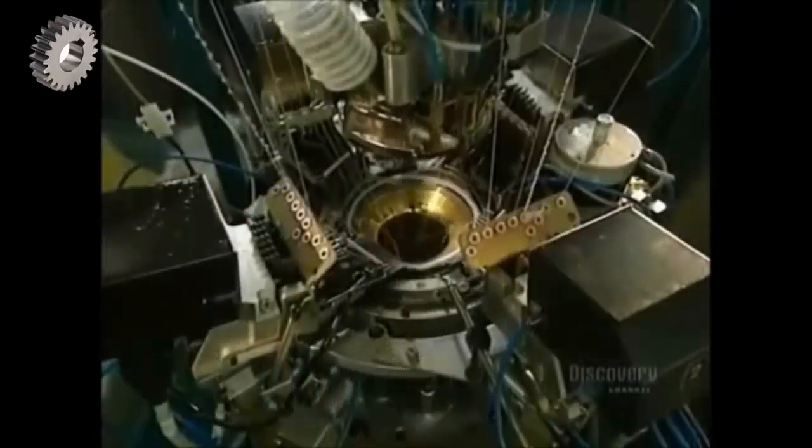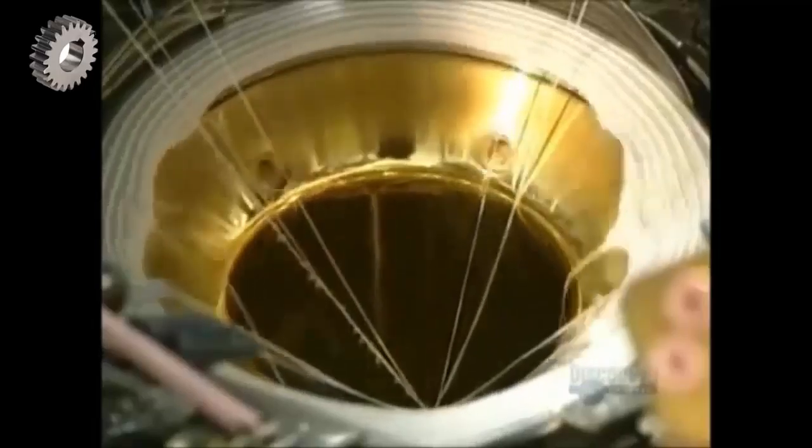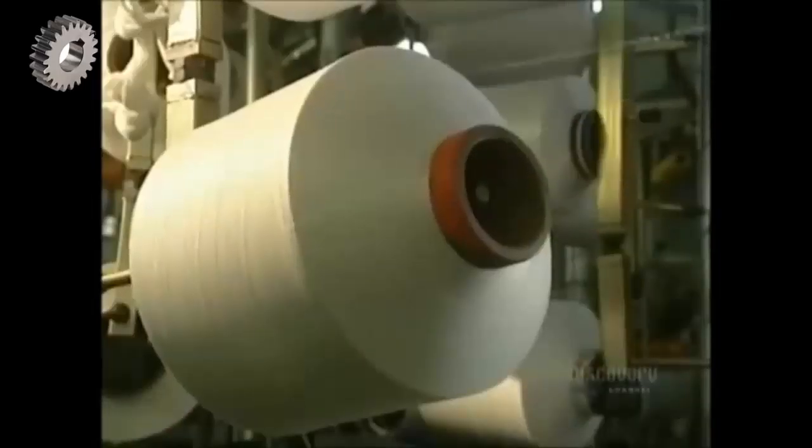Making a nylon stocking takes only a few minutes. However, it's a complex operation that involves the knitting of 5 to 8 threads as fine as a hair. The threads, usually nylon and spandex, strong and elastic, are used. Sometimes polyester or cotton are added. The knitting machine goes into action.